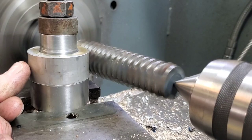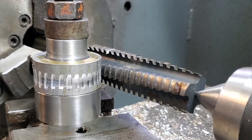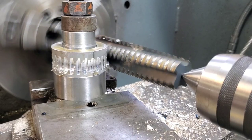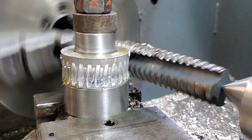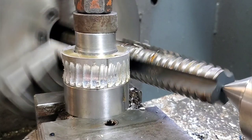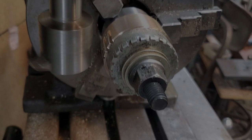As we start this, it's gonna look really good. Your outside diameter is super important as well — it's kind of like Goldilocks and the Three Bears. You don't want too big and you don't want too small. If it's too big, it's gonna start to look good like this one does, and then it's gonna start cutting in just a little bit out each time. The same goes for if it's too small — instead of cutting 24 teeth, it cuts 23, and even at that it might not match up. Pay special attention as it's going around — it looks really good right now, but as it goes around it starts to get out one step each time, cutting a little bit more and more. And now it's looking pretty bad — this is definitely going into the scrap pile. I've got lots more where this came from.